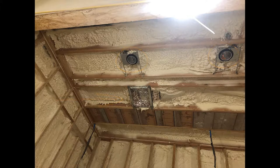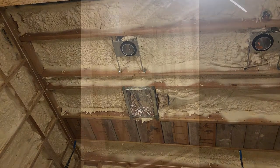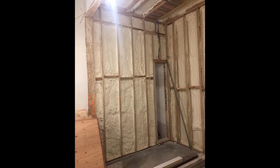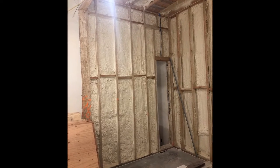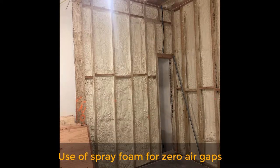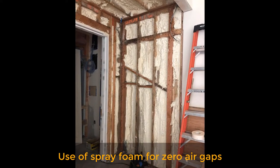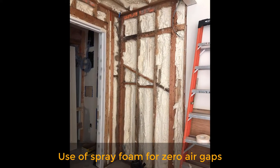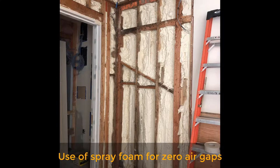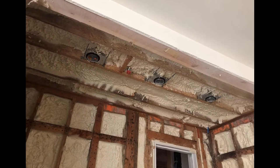This is just after it's been foamed. Polyurethane spray foam is the best type of insulation — we get a specific contractor who does the spray foam, and he applies about 2.5 to 3 inches of foam material to the walls to make sure the insulation and vapor barrier are installed properly. When correctly applied, the spray foam ensures there are no areas for vapor to penetrate through. You really want zero air gaps, because warm air mixing with cool refrigerated air creates condensation, and this will prevent that condensation on the glass.